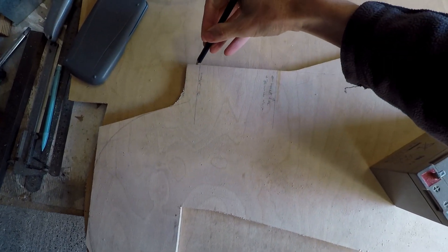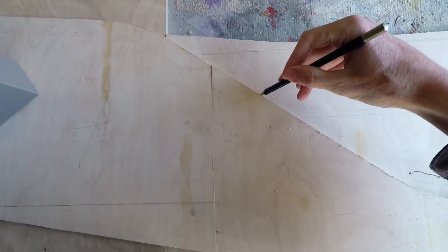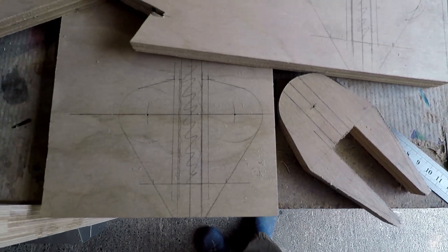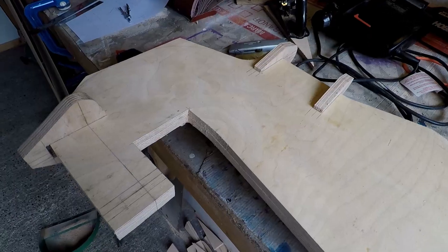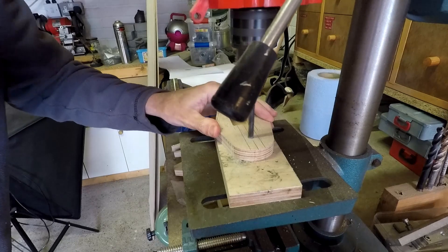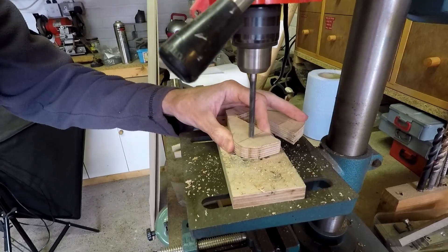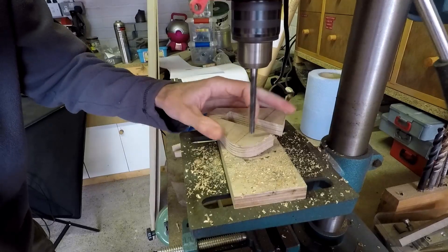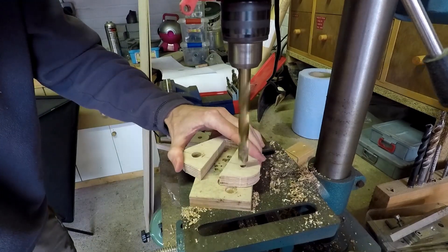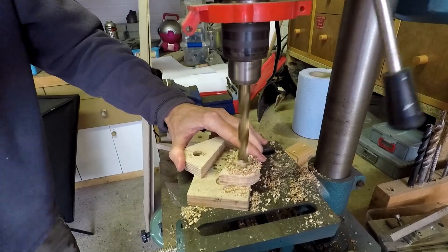I'm now marking the shape of the first half of the body onto the second half. Now these are the mounting plates for the pivots for the tilting arms — these will slot on at the front and they'll be glued on using wood glue. I'm now drilling through the mounting points so that I can fit the bearings or the bushes. I'm going to be using plain bearings for this prototype — drilling a pilot hole through and then drilling through, I think it was 13mm. Plain bearings will be araldited into these holes.